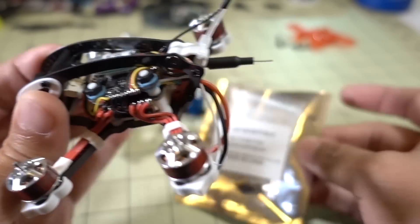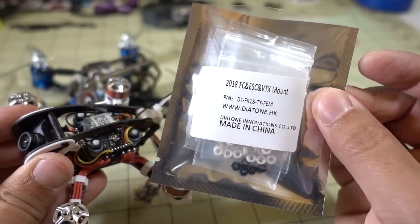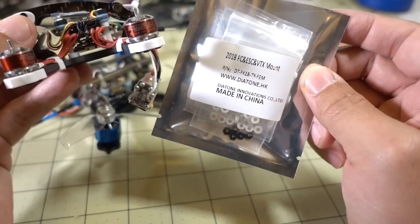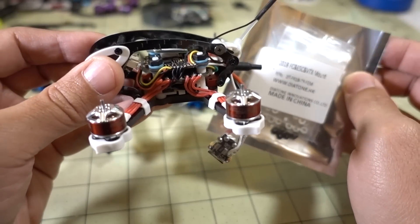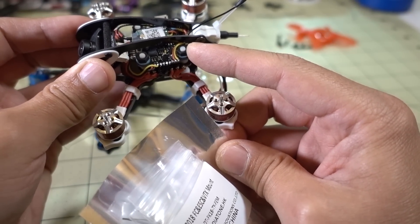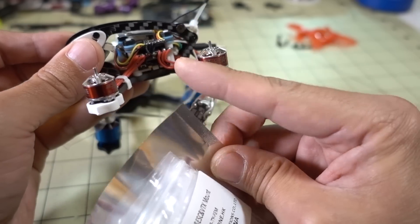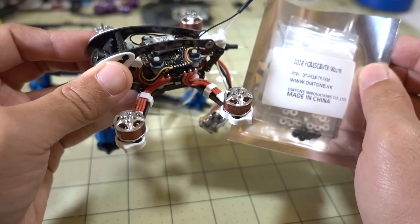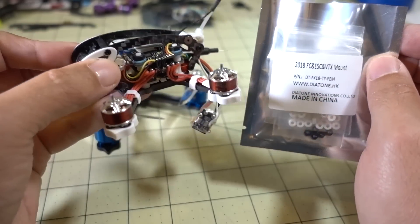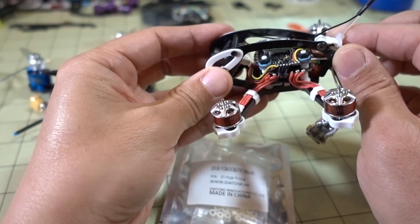They've sent me their little kit to do the conversion. It comes with all the parts to change the stack over, and I think it's $2.99 on the Diatone.hk website. They also sell a solid capacitor that's going to be on version 2 as well. You have to solder it to the 5-volt line to clean up the video noise from the TBS Unify. Supposedly the solid capacitor will clean up that noise.